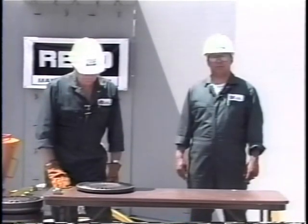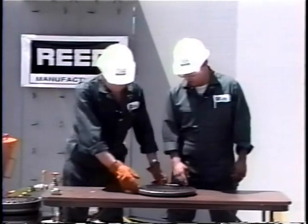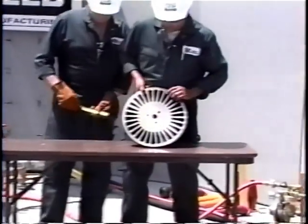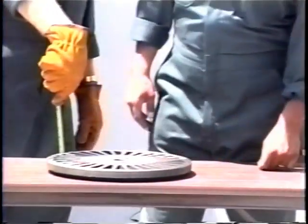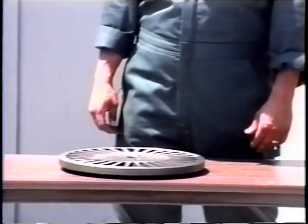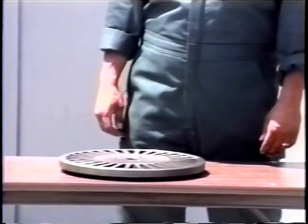Reed has a very wide range of feed wheels available to cover many applications. The first feed wheel available is the lowest volume feed wheel — it's a 30-pocket bowl with no wear plate. There are 30 individual pockets, and the depth is only one inch thick. This will convey between one to two cubic yards per hour with very low air consumption, somewhere in the range of 185 to 250 CFM, usually with three-quarter to inch-and-a-quarter hoses.